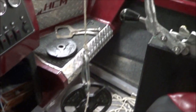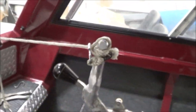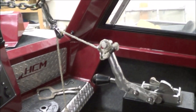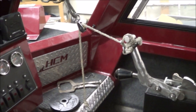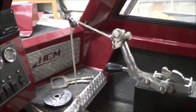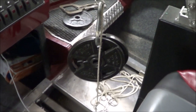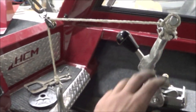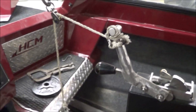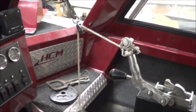Now the new cable is installed and I'm doing the weight test. Ten pounds gets the helm moving pretty easily — maybe seven or eight pounds is the threshold — versus 25 pounds before with the old cable. That's a factor of about three easier, which is a lot. Adding weight to the bucket with about five pounds plus vice grips: 20 pounds at the helm moves it now, compared to around 60 pounds before. Again, roughly a factor of three improvement.